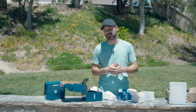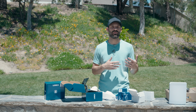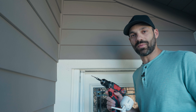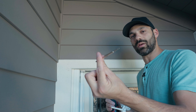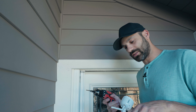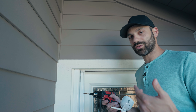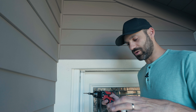These cameras have a 140-degree field of view, which is really wide. I'll find the right mounting points, install them, and then move on to the app. Lorex gives you everything needed for installation in the box except a drill — the wall mount plate, a reversible screwdriver with Torx and Phillips bits, drywall and stucco anchors, a drill bit with a masonry tip for drilling through stucco, and screws. Just make sure your hardware fits through the plate and sits flush so the camera slides on over.